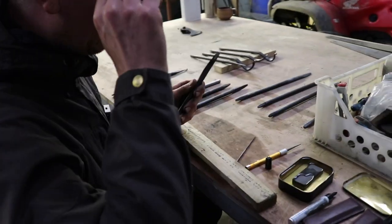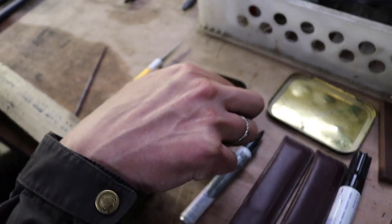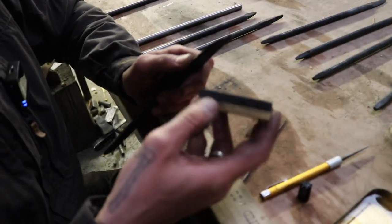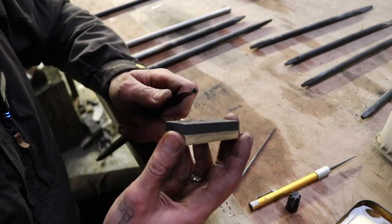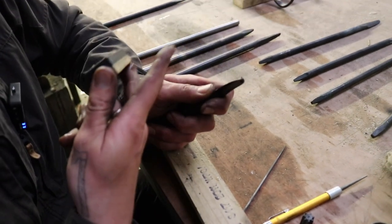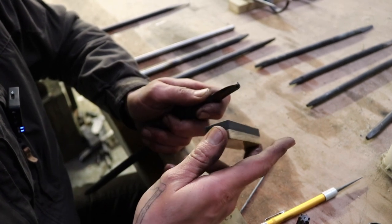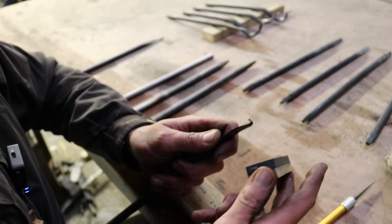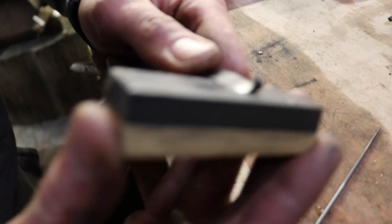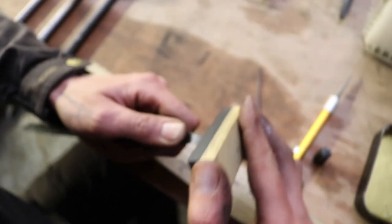So depending on how big that burr is, you can use different files, or some fine water stones are completely good. There are different files, diamond files, or the stones. Stones last much longer. The diamond files just have a coat of diamond material on top, but at some point this is gone and then it's not that efficient anymore. So I quite like stones. That's when it's getting a bit squeaky sometimes.